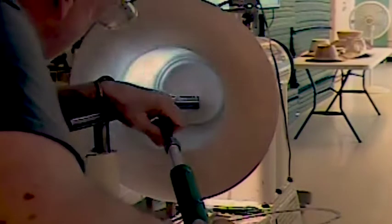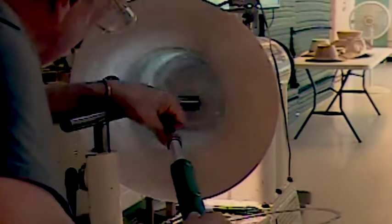And we're just about the end of our white wood. So our white wood has been bright up until here, but there's no more white wood, so we got to be careful not to make it too bright there, because it'll be too thin. Hog the middle out there, so now I can put the horn of the tool rest up in there to get closer to my work with the tool rest. Yeah, I made the flat spot there at that height. I need to go up another 3/8, make that all flat, and then go up in that corner.